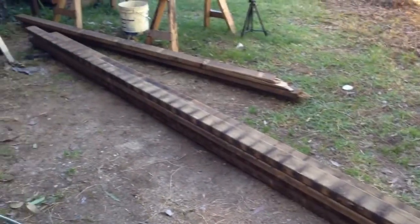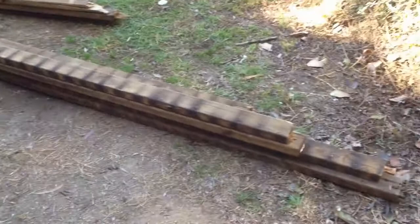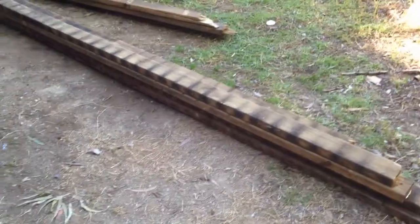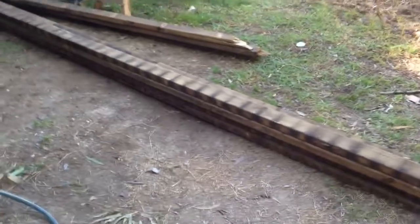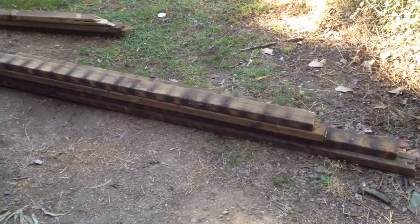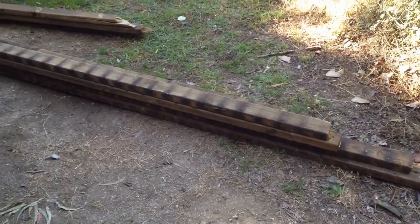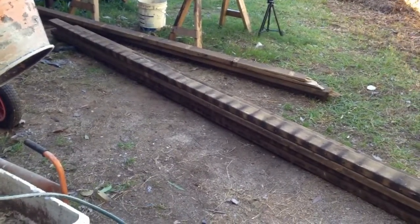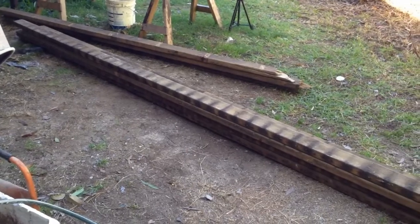These are my only parts that are over 10 feet. So instead of using the full frame thickness, I'm going to rip stuff down to be 2x2 rather than 2x4, as it's only meant to be in there is a little bit of extra support and giving something to put the paneling on the inside on.